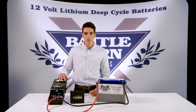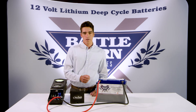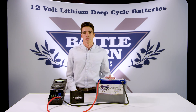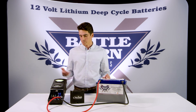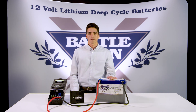One more thing: if you're using the temperature monitor, disconnect the cable that is supplied from the charge controller to the battery to monitor temperature, because our batteries don't need temperature compensation. Typically with lead acid, you need temperature compensation to account for changes in temperature — the charger will either raise or lower the voltage depending on temperature. But we don't need any of that with lithium ion batteries. That's all, thanks for watching.